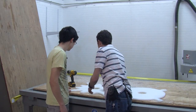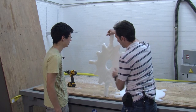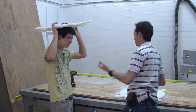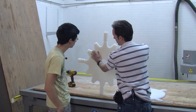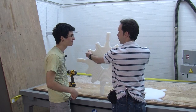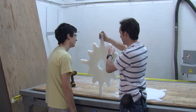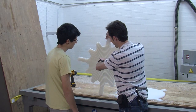Our cutting's done. We've got this unscrewed, so now we have our top piece — nice pretty UHMW. The secondary coil will go through here, and the primary coil is going to go here, and it'll actually bridge out here, which will make tapping really easy. If we're really lucky, your tap point will end up out on one of these turns, so that'll make things really easy. We have to drill this out in here, but that's trivial and easy to sort out.